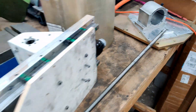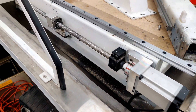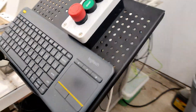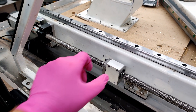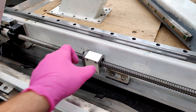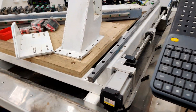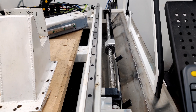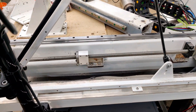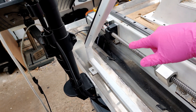When taking this all apart I found the nuts for the Y-axis are a bit loose - they developed a bunch of play in there, both of them. These are SFU 1610, and I've since ordered DFU double-nut in 1605, so half the pitch, and hopefully that'll last a bit longer. If they don't, I might modify everything in the future to go up to a 20x size - a bigger ball screw.